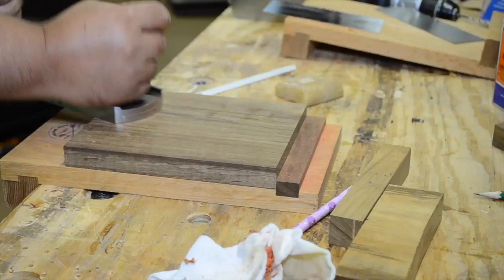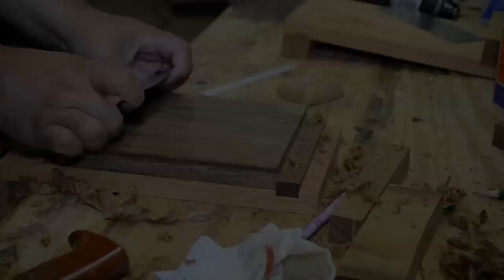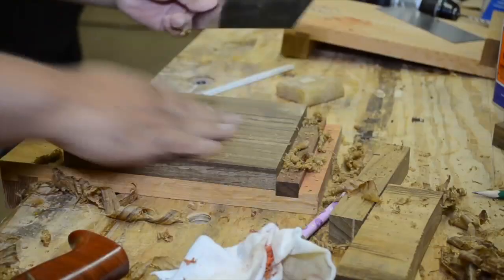Now, with this particular scrap offcut, the surface is pretty much already milled, so it's a matter of planing it flat on both sides. Then, as a final smoothing operation, I'll use my card scraper to help blend any blemishes from the plane and clean up any tear-out. To soften the edges, I'll simply round them over with my block plane.